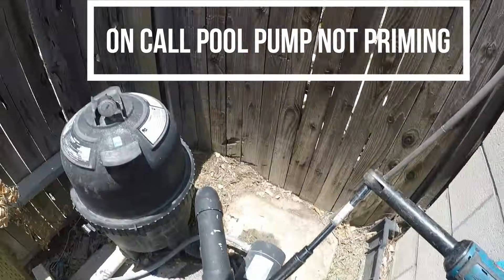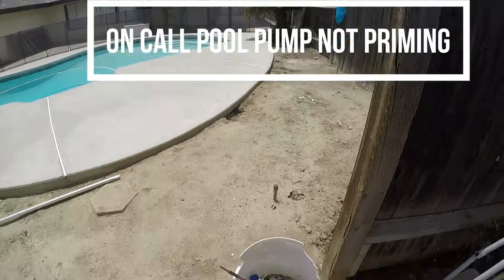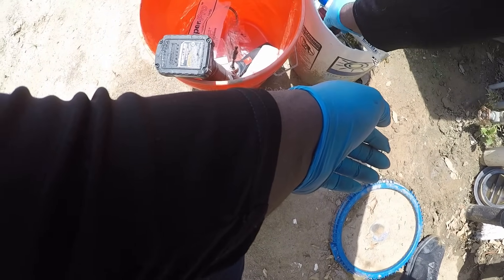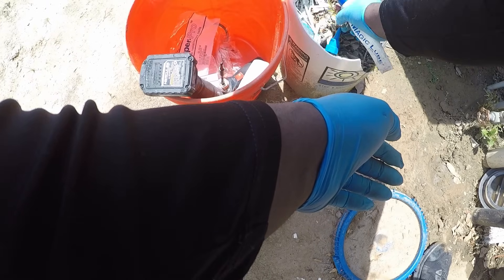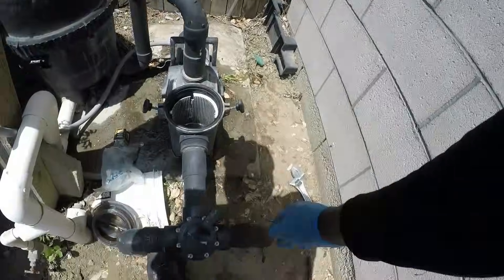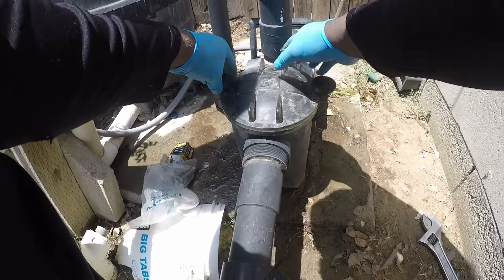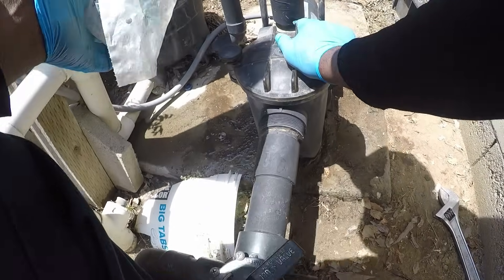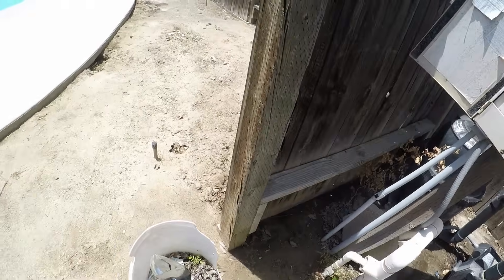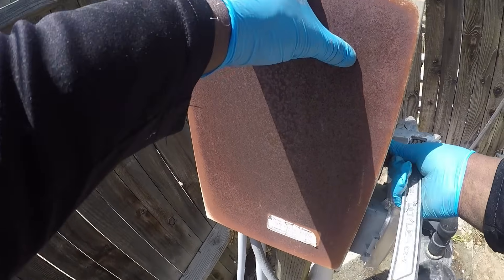It's good to ask if they have a home warranty first. If this was just a pump gasket or pump seal, I would have replaced it, but now we've got a broken impeller — it's going to cost a lot more than a home warranty co-pay or deductible. Home warranty can work it out. You guys got to see what was going on for the diagnosis, then we're going to hit the breaker, put it down — thank you for watching.